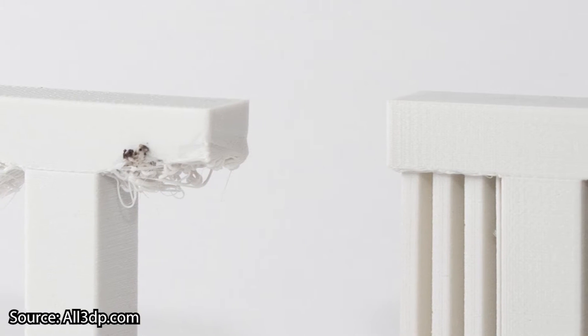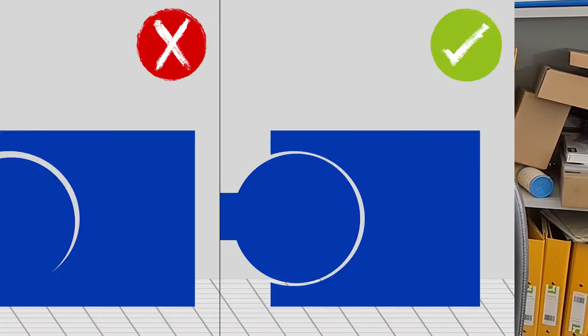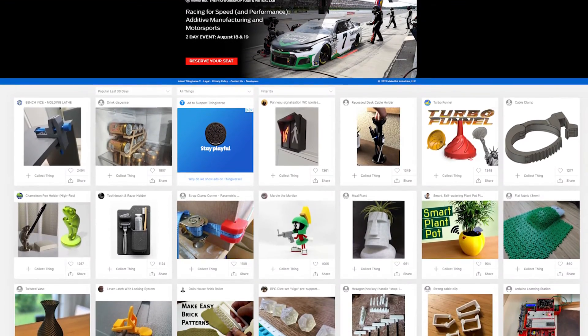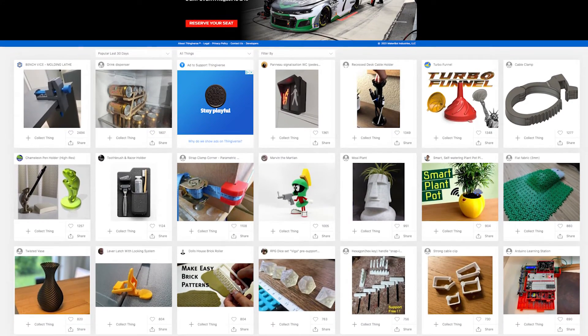Most of you already know that some models require supports when printing with overhanging angles more than 45 degrees. Keep this in mind when generating supports, as they need to be easily removed and shouldn't stop the model from moving. It's also important to orientate your model so that any supports won't fall and fuse with the rest of your model. Now if you're not designing the model and just grabbing it from somewhere online, you don't need to worry about these factors as much, as the designer would have already thought about them. Except if you're resizing, you will need to double check that gap tolerance and when adding supports.